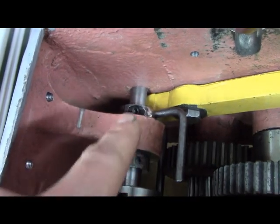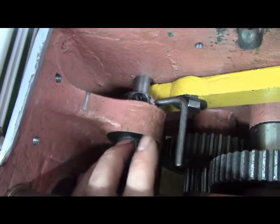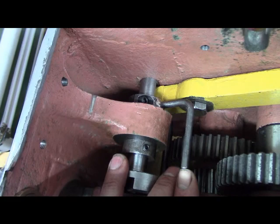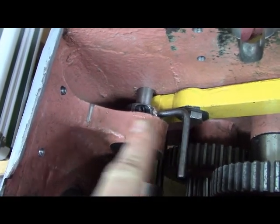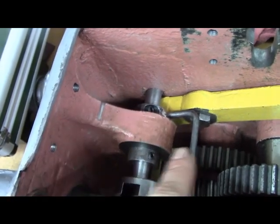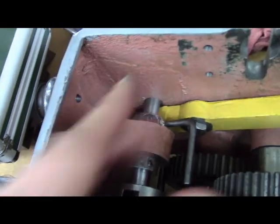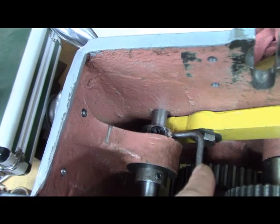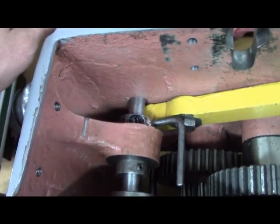So I said, let's just turn the whole piece, straighten it out. So you heat it red with the torch, and then you just squish it flat with a vise, and it's good back to normal. Then you're not going over as far. Once I took that bend out of it, that little zigzag, then to get to my destination, I got to rotate it more and then clamp it, so therefore it doesn't come over when it's in the retracted home position. So that worked out super, super well.